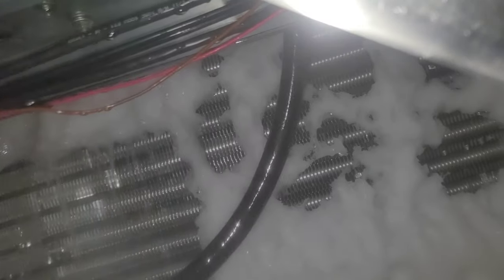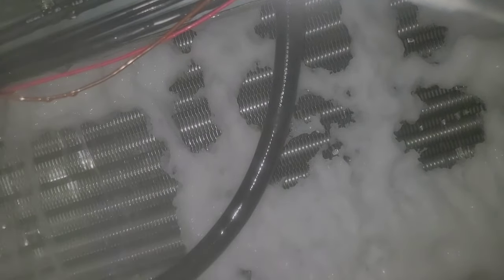Got to be careful with these big slabs of ice. With smaller evaporators you can just melt them off the coil and let them fall, but if these big things fall they could rupture the copper — you gotta really watch it.